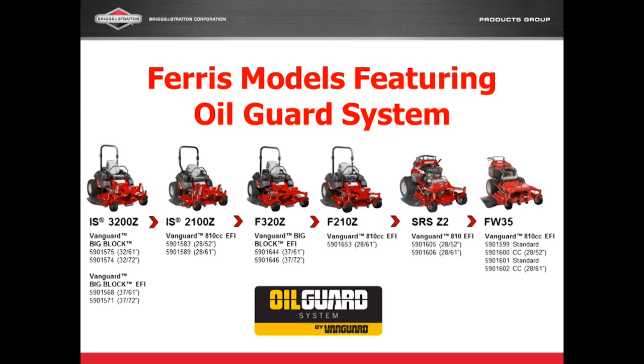Then we move to the Ferris Fleet series. The F320Z has 2 37 horsepower models, again with 61 or 72-inch decks. And the F210Z features a Vanguard 810 EFI, 28 horsepower, 61-inch deck. We have the SRS Z2 stand-on in 28 with 52 or 61-inch decks. And finally, we have a stand-on unit, the FW35. It is available in either standard or comfort controls, 28 horsepower 52 or 28 horsepower 61-inch decks.